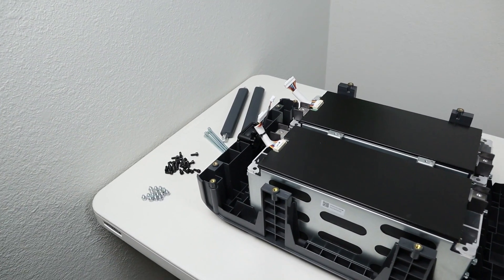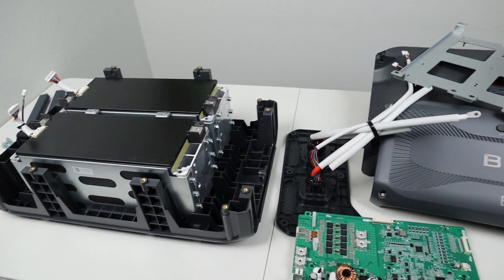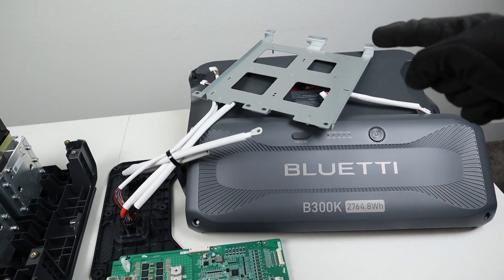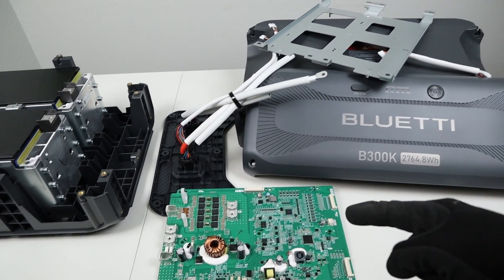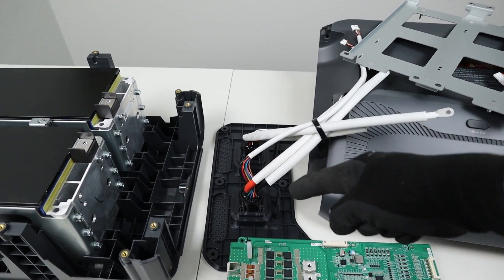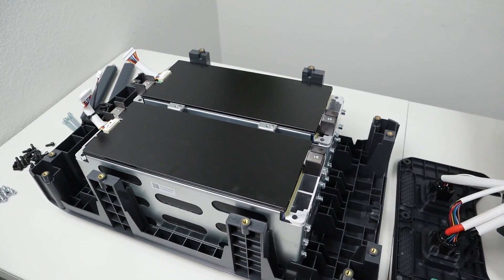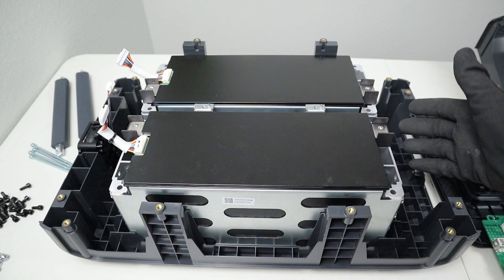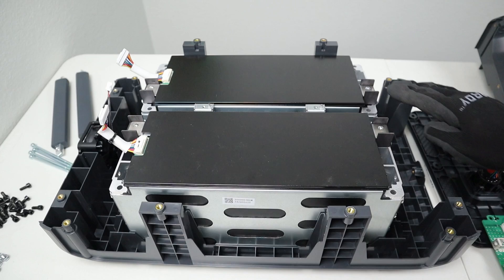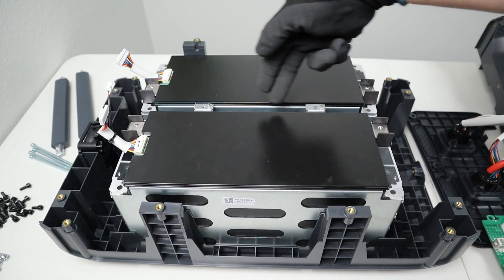As I've been tearing this down I've been very impressed with the build quality and organization of this battery. You can see it's just laid out here on the table. I have the outer shell over here, there's a support system for the main board and BMS, you have the main cables that go to the expansion ports and connect up to the BMS, and right here you have the actual battery system. The internal batteries are extremely rugged — these are full metal cases. There are two of them, you have the fan over on this side and it blows air through the middle channel.